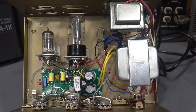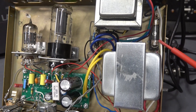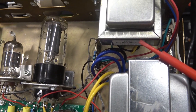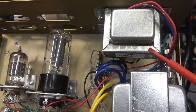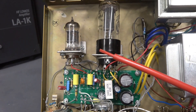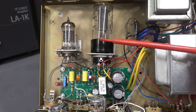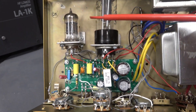Here's the inside of the amp. This is your power transformer. Got a line fuse over here. This is the output transformer — this is the new Champ-style sold by AmplifiedParts.com, a great little transformer. The tubes are mounted on right-angle brackets so they lay in here. Got a 6V6 and a 12AX7.